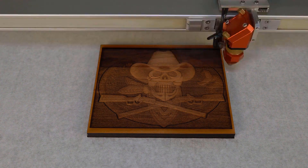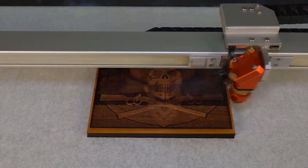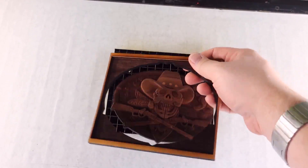Resulting in a beautiful 3D effect on the surface of our material. As this technique typically requires multiple passes, we recommend solid tight-grained woods like cherry or maple for the best result. For this example we'll be engraving Trotec solid cherry wood at a high laser power and slow speed across three passes in order to achieve a sufficient depth for our 3D effect.